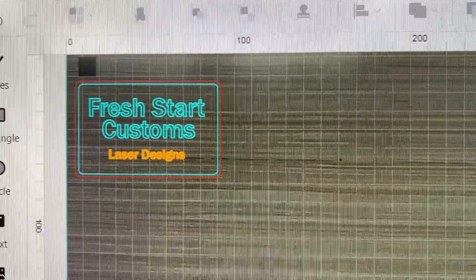I've got a small design here that I'm going to create — just a small little plaque. We're going to put it on the 40 watt WeCreate. The test cut is done already. We're going to use all the preset settings for the scores, engraves, and cuts. I'll auto focus and we'll have it go at it. The 40 watt is all auto-focused and ready to hit print. I'm going to send it to the printer now. It is now doing the engraving — I did a pretty light engraving here but it's still turning out wonderful.